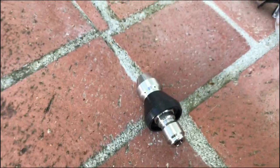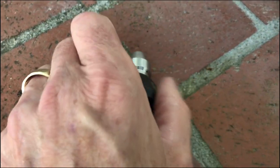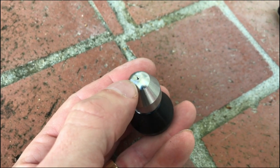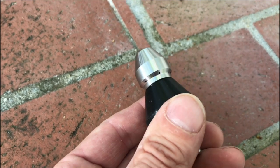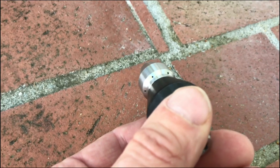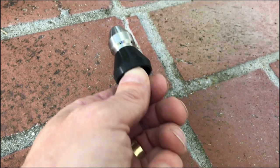Now it's going to be part two — trying to clear that drain of that mud. I purchased this jetter nozzle from Chalco. The design is you hook this up to your pressure washer. You get a high-pressure forward stream of water, and then you get these rear holes which shoot the water backwards. Hopefully those rear jets will, with their pressure, help draw the nozzle forward and bring it down the pipe.